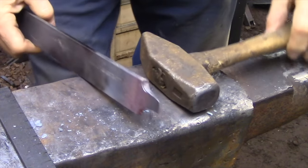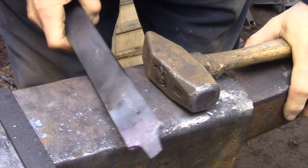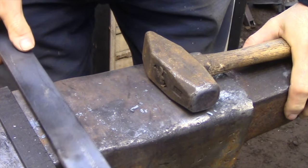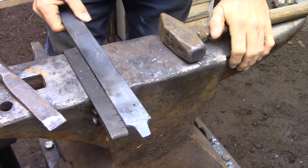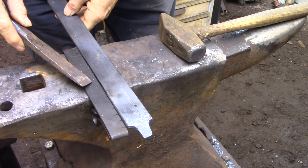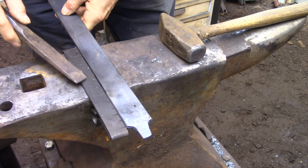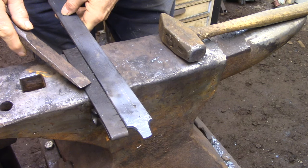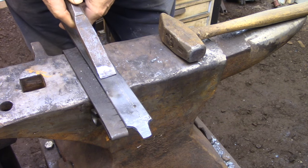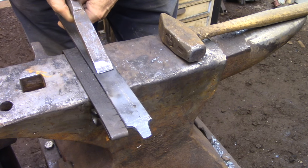To set that up I need to forge a very thin wedge-shaped transition on the end of this bar that's going to fit inside that forked piece that I'm going to be splitting out. It's a weld that isn't used much today, but when you examine old iron work you see that it was really used quite extensively. I like using it because it gives me a simple way of holding these two pieces together — they stay as one piece in the fire, I pull them out and they get welded as one piece without any complications.